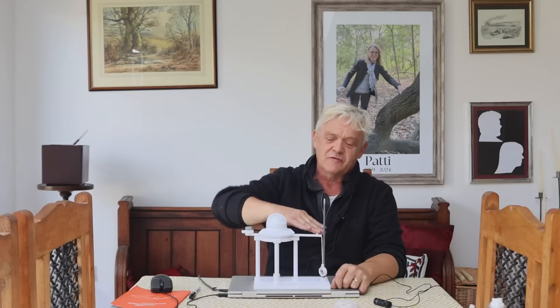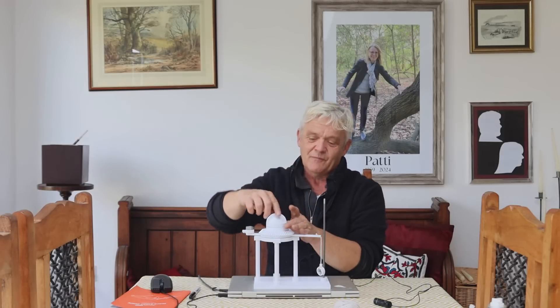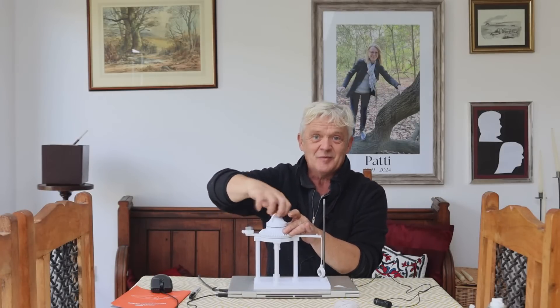And there it is with the pendulum tied on. You might have noticed this — it's a counterweight that I added, because I forgot that when the pendulum is on, it's going to tilt that wire. So the counterweight keeps everything nice and level, and I've added that to the drawing. Now all we have to do is hold the cog and wind it up.